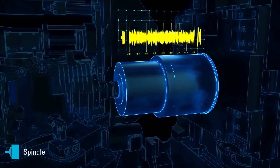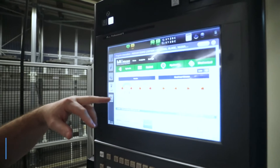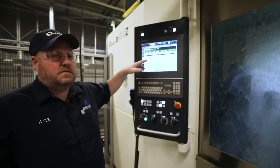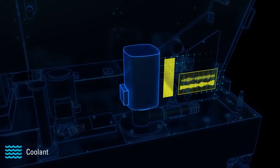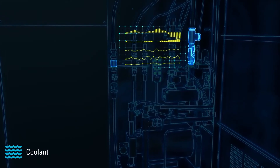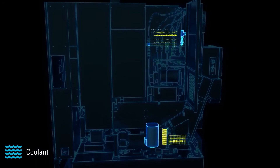This one's really helpful for us—coolant flow. This is telling you how many liters per minute is coming out of your nozzles of your overhead or your shower, what it's set for, and the variables that are min-max. It's also controlling my coolant temperature. We have a coolant chiller on this machine and it's calculating the temperature of my coolant at all times. If you look at your liters per minute and they're to the low side, you may have a clogged line or some form of debris that you may have to address on preventative maintenance.